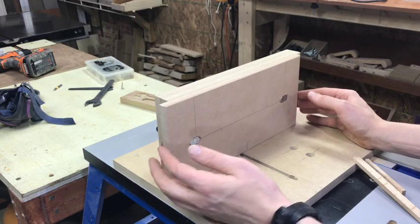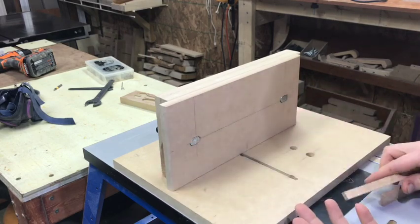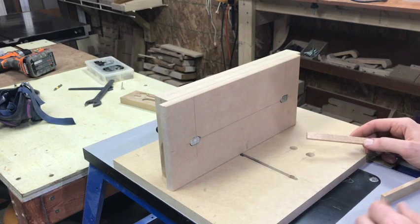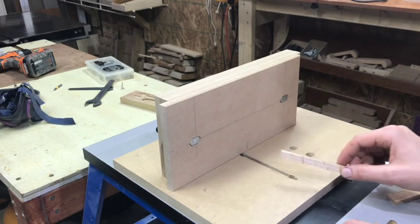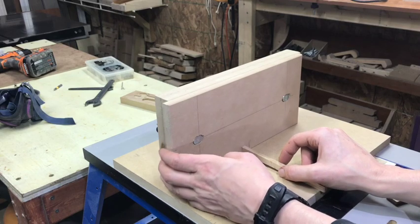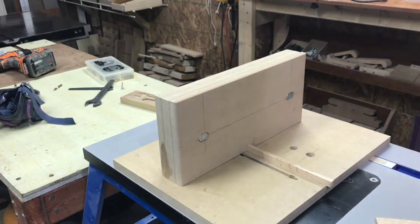Set your faceplate off to the left by about a 1/2 inch. That way, if you're using a 1/4 inch router bit, it will be twice the size of whatever your router bit is, roughly. A 1/2 inch bit, you'll want to be at least an inch over, and so on for any bit given. So then we'll put our hole there. This will move over a 1/2 inch, essentially, our bit and our spacer.